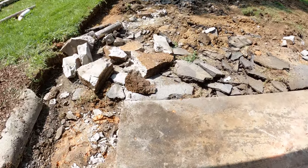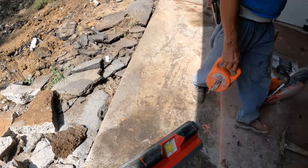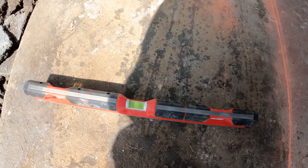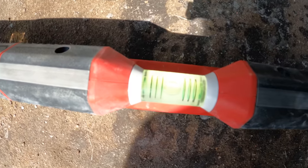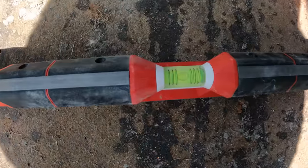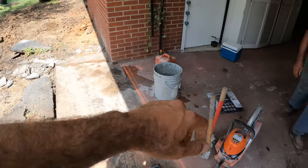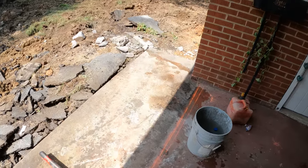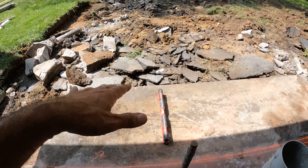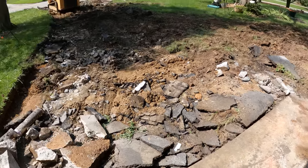Okay, I wanted to show you really quickly. One of the things they tried to do with this asphalt is get this carport to stop flooding. So look at what's going on here. This thing is barely breaking towards the carport. So what we need to do here is cut this old concrete and then get our channel drain set lower so that it slopes into the channel drain. So this is a very tricky house.